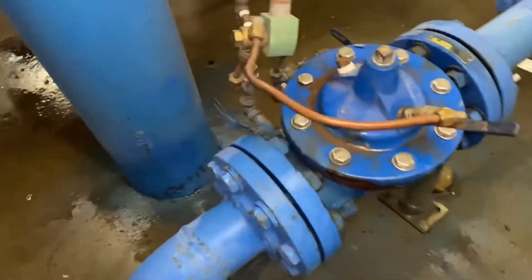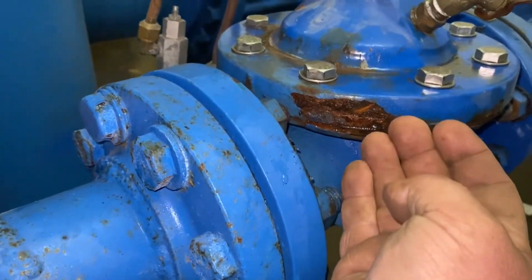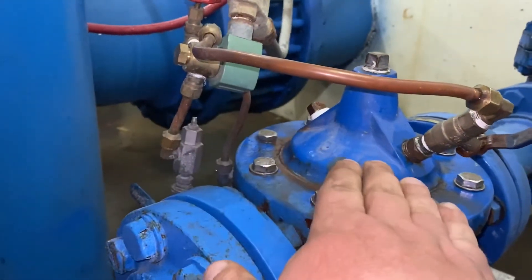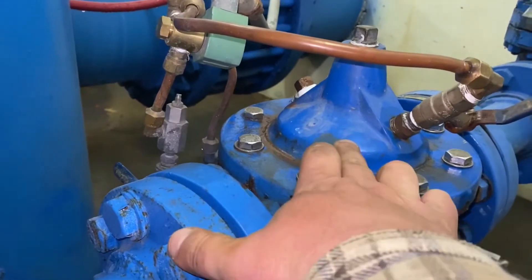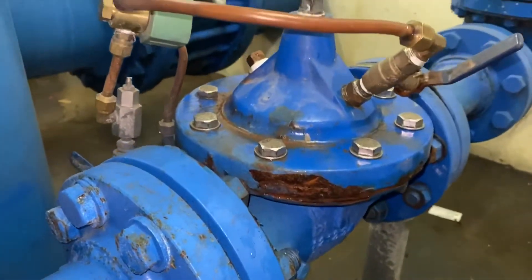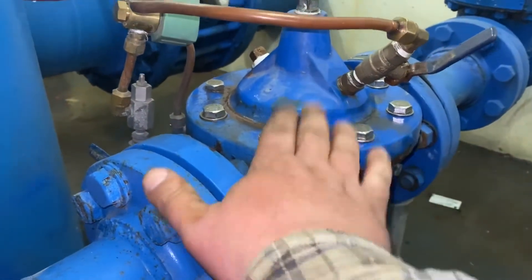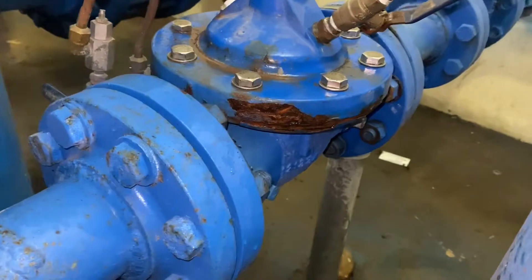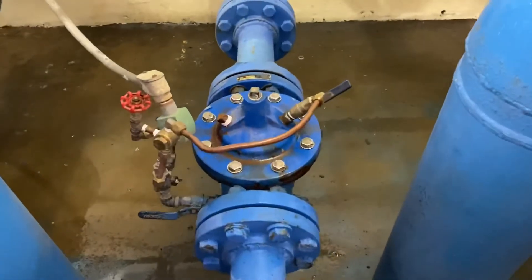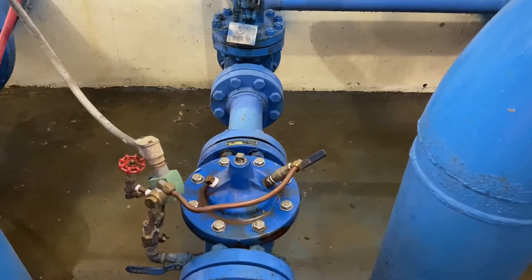See how this works: water comes in this way, has to come up through that stainless steel disc and back down. When this activates, it forces water on the bonnet — in combination with the spring, forces it down and makes it drip tight. Now, like on a pressure reducing valve, there wouldn't be a solenoid, there'd be a pilot, and it would modulate that. But the internals are exactly the same. It's pretty echoey in here, and I don't know how much this will help anyone, but if it does, this is Adam from Small Town Machine Shop. Please comment, like, and subscribe — thanks for watching.